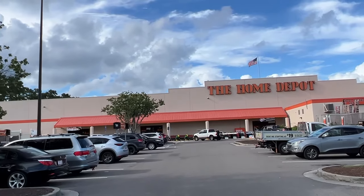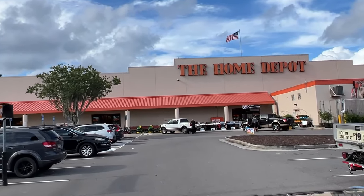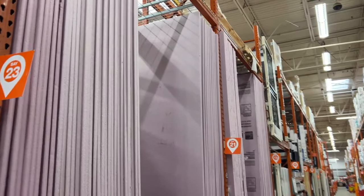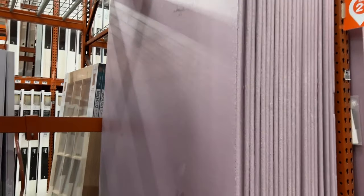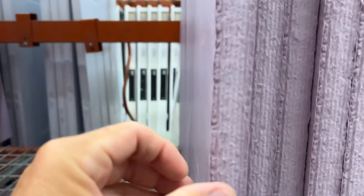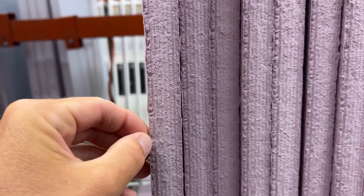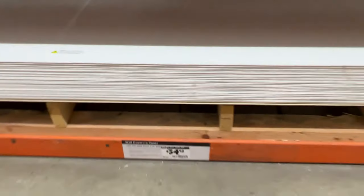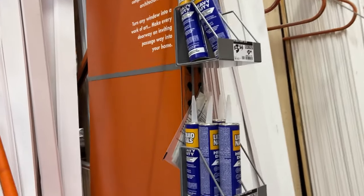Now it's time to tackle the floor system. I wanted to keep everything nice and light, so I made my way to Home Depot and went straight to their insulation section. I found a product called R5 — a super lightweight, hard, dense foam that wicks moisture, similar to what's used in homes. I picked up a four-by-eight sheet of the one-inch thick pieces, which matched the rib height on the bottom of the john boat. Next I needed a material to sit on top — I found a thin PVC wallboard-style material, stood on it, and it felt pretty firm, so I knew it would work. I grabbed a can of liquid nails and headed back to start the hardest part of this project.